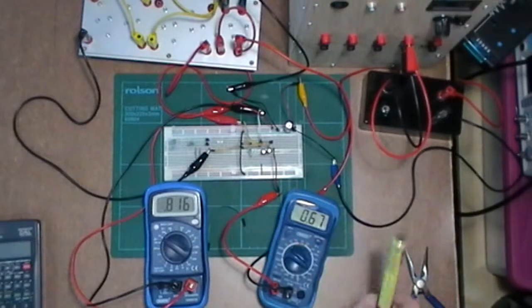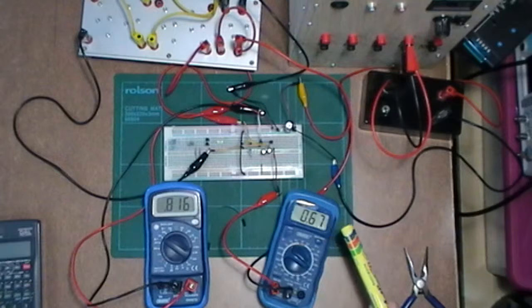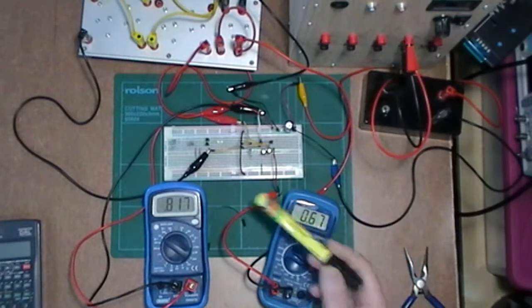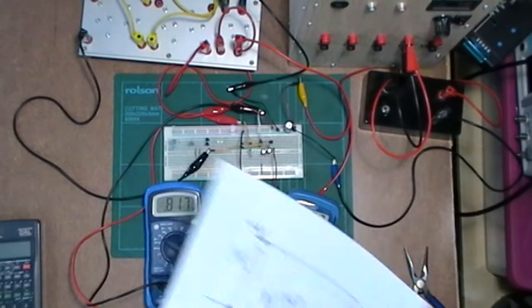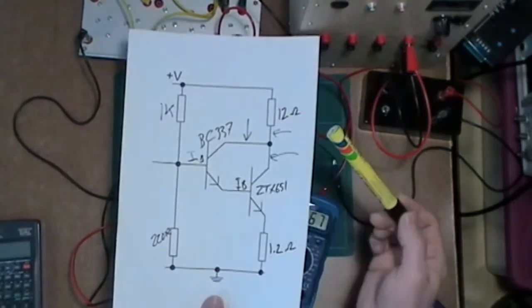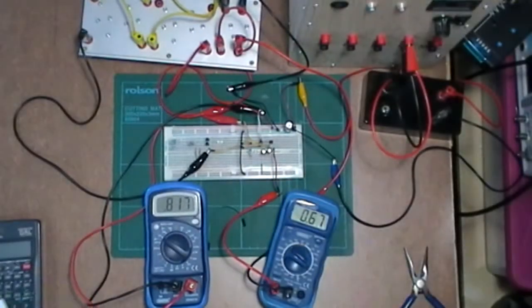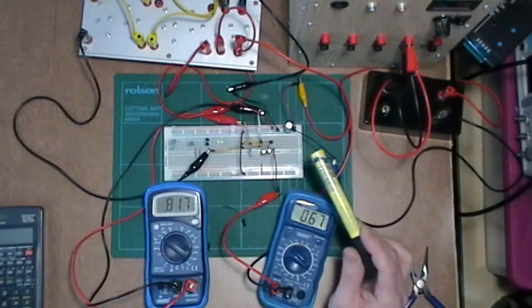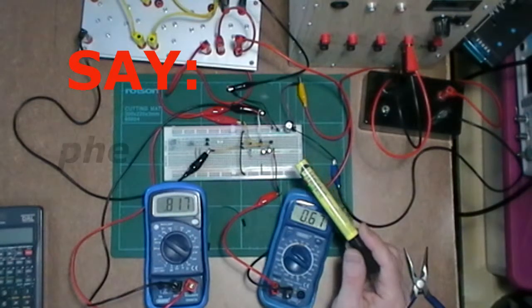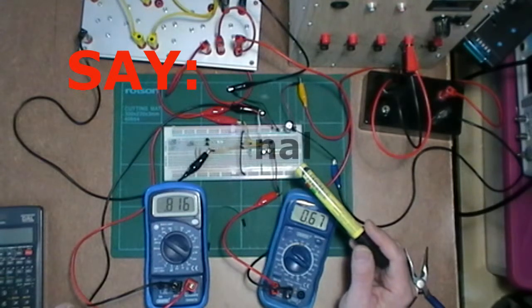Yeah, I've got quite a bit of gain there, quite a bit of current there, loads of current coming out. But the best scenario was with the smaller amounts, with the other circuit, with this resistor divider, 6 microamps, 7 microamps on there, and about 580 milliamps, something like that, on the output. So the gain was phenomenal.